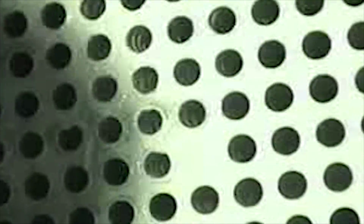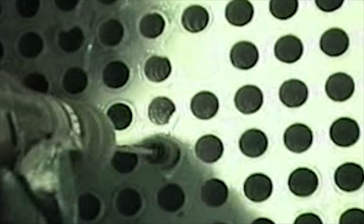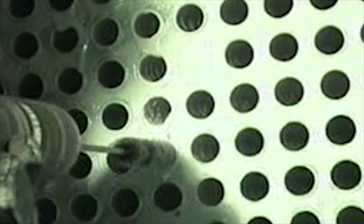Here, the initial application down each tube, we're applying an amount of material to the end of a wire tube brush. You can see you put enough material that you'll be able to go down and do about 3 to 4 tubes. Work it in with several passes back and forth. Object here is to get the best adhesion we can.